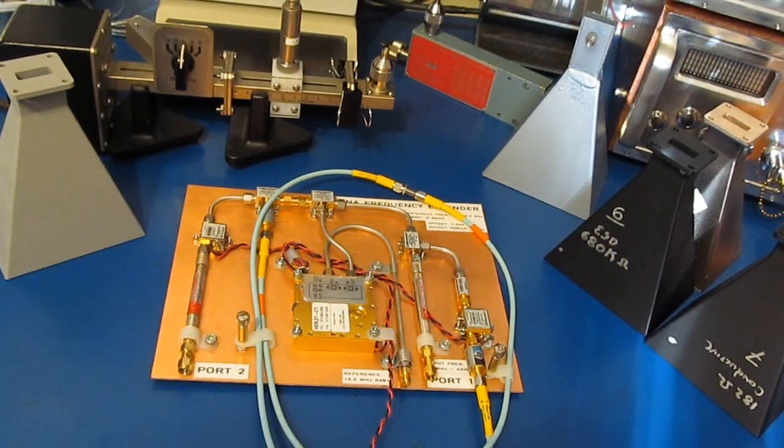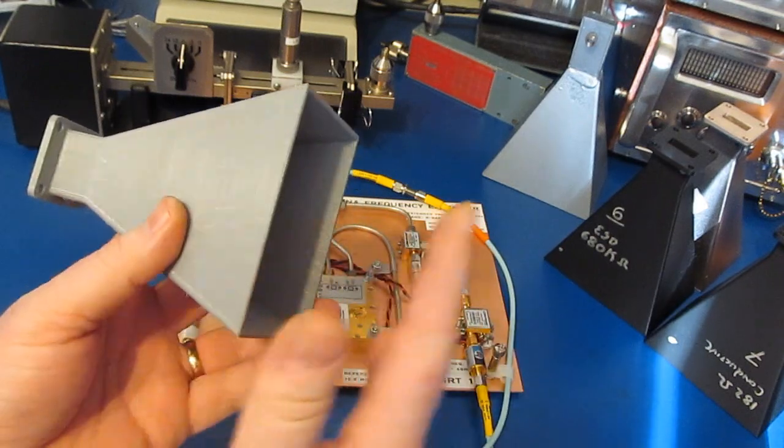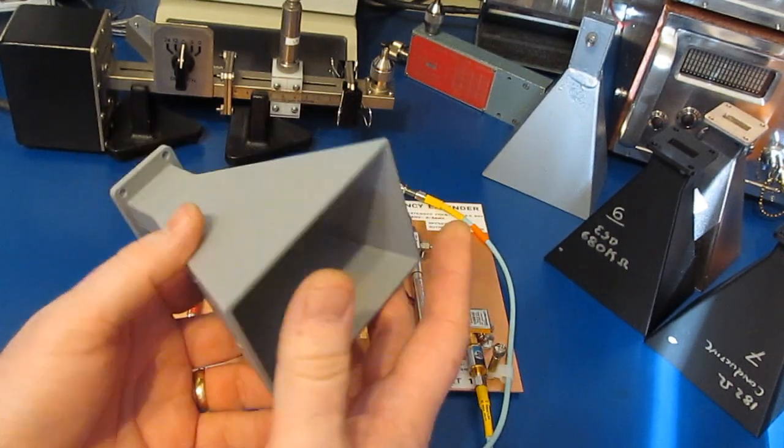After posting the last video, somebody had mentioned that Signal Path's channel had made a video on 3D printed waveguides. So during this video I'd like to go over some of my own testing of 3D printed parts. So we'll be looking at the radiation pattern as well as the VSWR for these different horns.